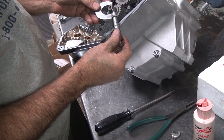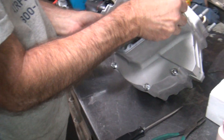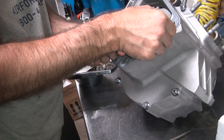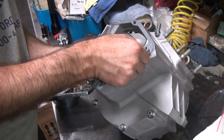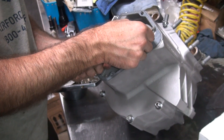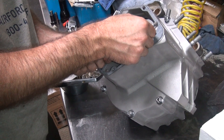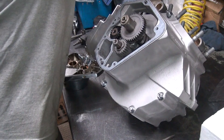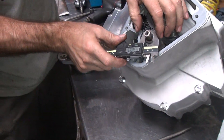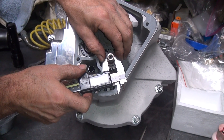Something's going on right there. So you can measure with the mic and see if it catches it. I'm thinking maybe there's a burr - the shaft does not grind all the way across would be my guess. But the problem is getting in there to measure it. It's measuring 12 all the way across. Can't get in there enough to really measure it. See if we can catch it with the caliper then.